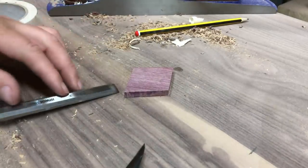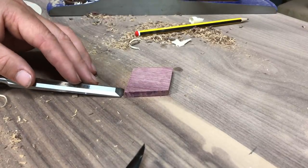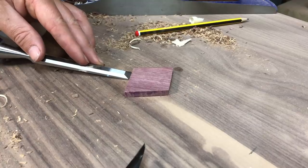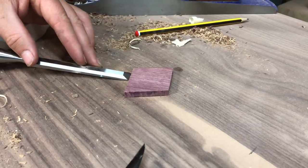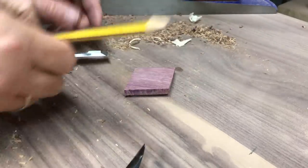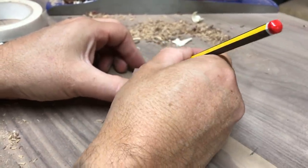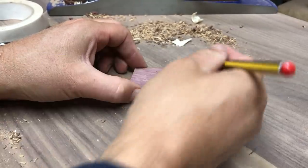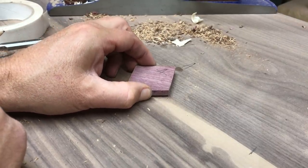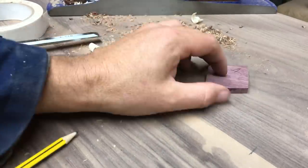And then again, taking this off, you've got to be really, really careful, because it's quite thin wood, and this could just split, and then that's it, you're pretty knackered. So you've just got to be really gentle about trying to lift this back off, because the sticky stuff sticks really well. And then also, as I said earlier on, mark up which way this goes. So I'm going to put an arrow here, and then put an arrow on the table, and then I know that it goes that way up, and it goes facing that way. Lovely jubbly. So there we go.